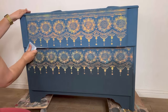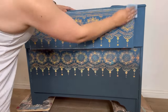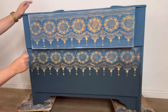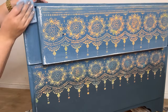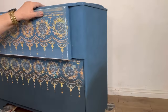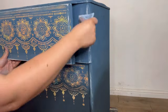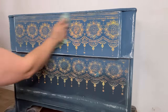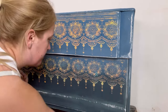Now as I mentioned earlier I'm just going to distress this back because I want it to have a really rustic boho vibe and I also want to be able to see peaks of the Moonbeam and the Quiet Cove which were our two base colours. I'm using 120 grit sandpaper and I'm just roughly rubbing it over the areas that I want to distress. Then I'm going to quickly wipe off any of that sand and dust and then it's time for the last part.